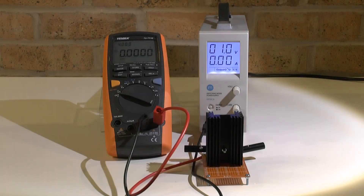Moving on and starting with testing our reference load on the power supplies. I know the value which is 10 ohm, and very importantly you have to avoid at that low level of resistance any additional resistance in the system — it will have crucial consequences in your measurements.